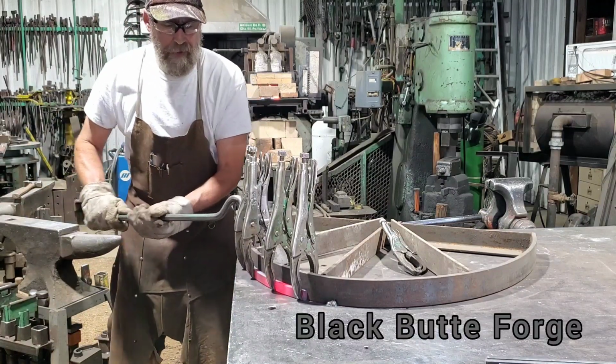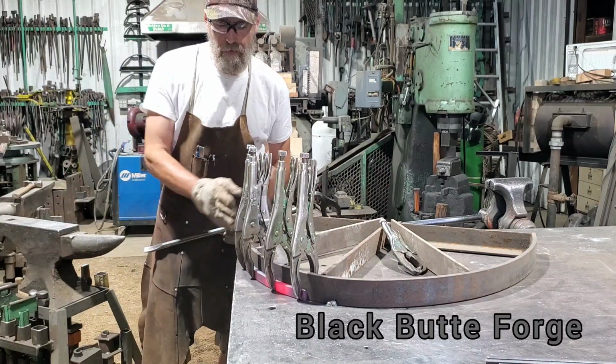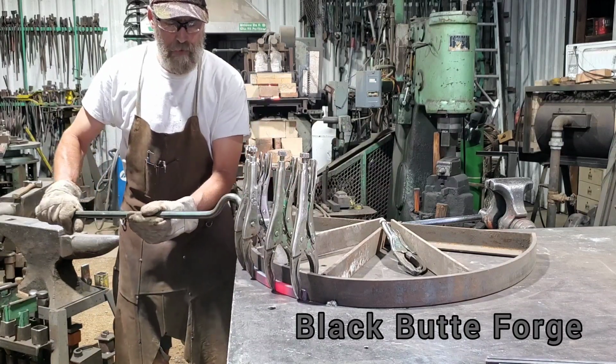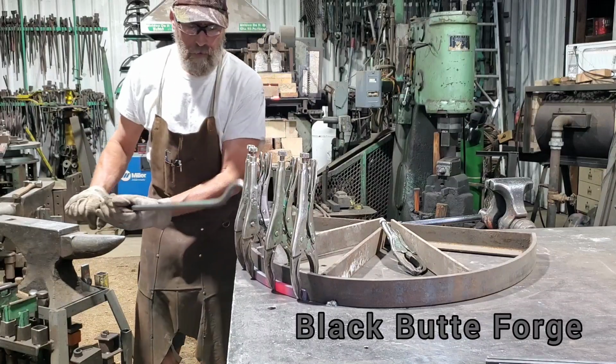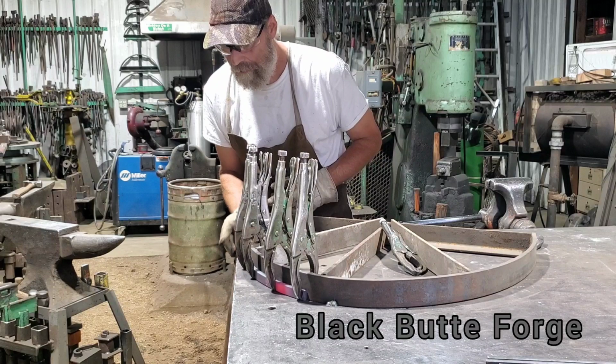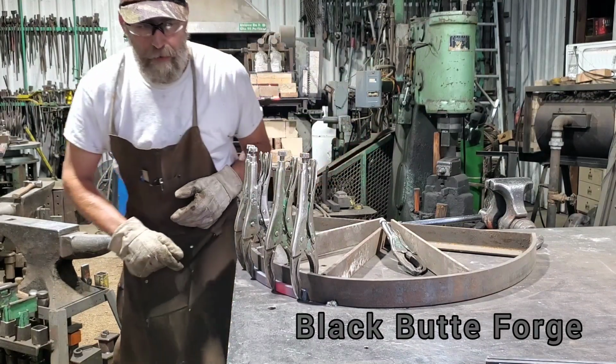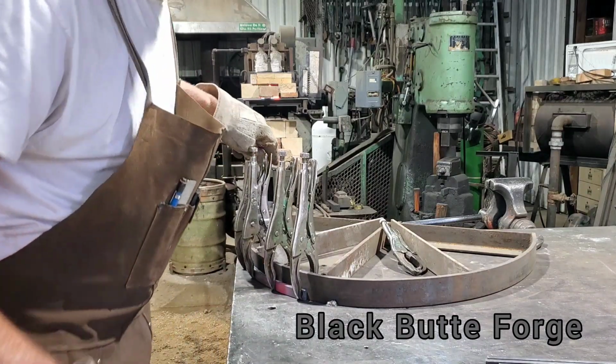And after you do a few of these, you'll get the feel. You'll know about how far you've got to go. And so it's sprung just a little, like a little bit more, so I'll come a little bit more. There it is. If you go too far, no big deal. It's still hot. It takes half the force to push it back as it did to go that way. That's pretty much a general rule of thumb when you're working steel.